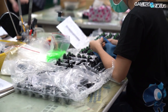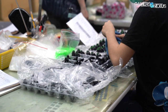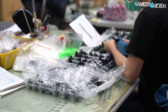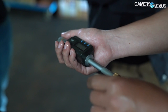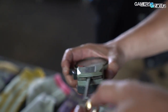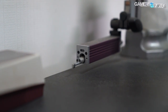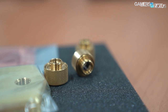As discussed in the previous video, there's one last QC process in the packaging area where everything is checked by eye. All of the R&D equipment — like the surface level measurements and the fitting dimensions checker — is used for both design and for QC after development. At the factory level, there are already a couple of checks where technicians pull units out of the tray every 20 minutes or so to visually inspect them and check the threads and levelness of fittings contacting the plates. After packaging and sending to headquarters, more precise testing is done to check tolerances, dimensions, and the overall visual appearance of the finished unit.